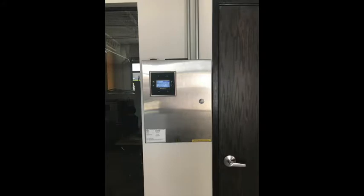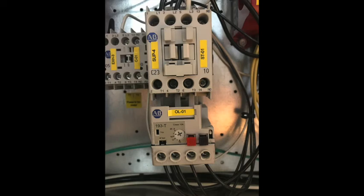Now let's open the control panel and find the contactors and overloads or motor starters. Remember it's recommended to turn off all the power to the panel before working inside. The door only needs a flathead screwdriver to open unless it was ordered with a key lock. Once the door is open you're looking for the contactor and overload pictured here. The overload can be identified by the two square buttons, one red and one black.